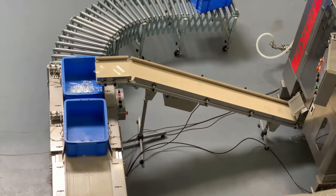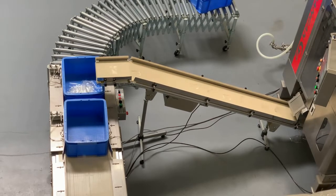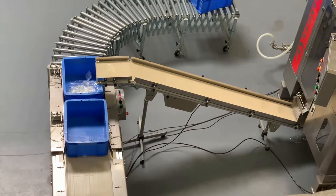One thing the industry demands is hot filling for food safety purposes. This can be a very challenging task for many pouch machines. The Dangan does it with relative ease, and furthermore, we can offer heat exchangers to aid in this process.